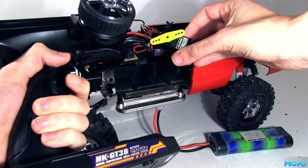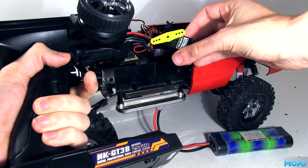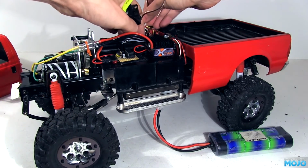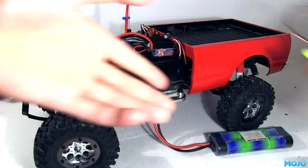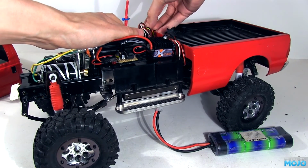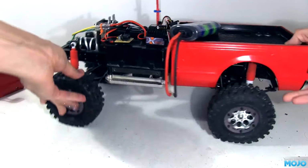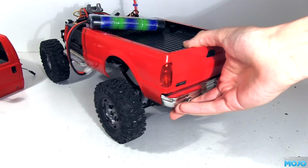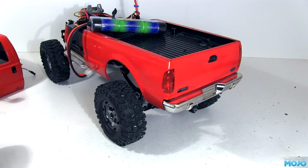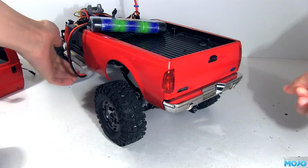Nothing special. The controller was designed to work with a common 2-position switch. The board just uses a signal that normally goes to the servo to decide if the power to the LED should be on or off. If I remove the servo and hook up the LED controller, spin the truck around so you can see the lights, there we have it. 4 channels usefully employed. Pretty neat I think, considering almost all car radios top out at 3 channels.